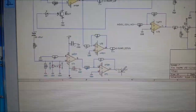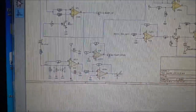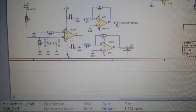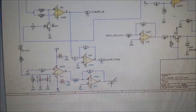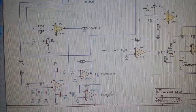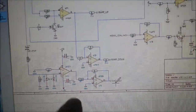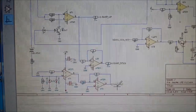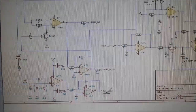This sine wave circuit has popped up quite a few times, but the values I've seen haven't worked for me, so I've tinkered and adjusted them to get a really nice curved edge sine wave, which I'll show you in another part. I'd recommend measuring the two diodes here and making sure their voltage drops match — otherwise your sine wave droops to one side, so matching them helps with symmetry.